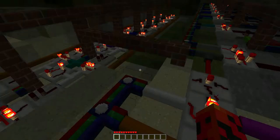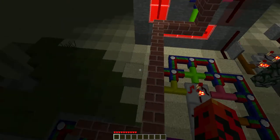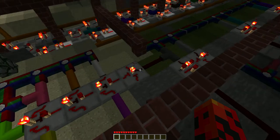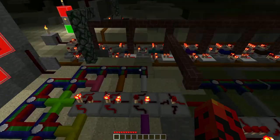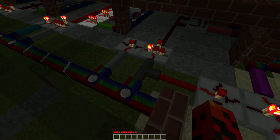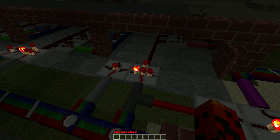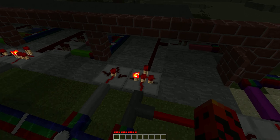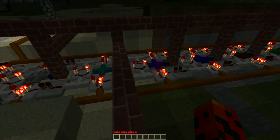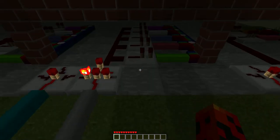Basically the way I did this is I connected all these with colored wiring, which obviously makes it a lot easier. So this is 0 — that's if this one is off, this one defaults to on. And then it goes to 1. The way I did that was I made number 2 invert and go to an AND gate, so that way if number 1 is on but number 2 isn't, this is on. And then if number 2 is on and then 1 is on as well because of how the arrays are, it'll automatically turn it off, allowing only number 2 to be on.